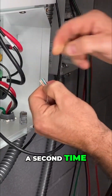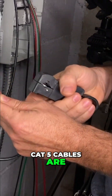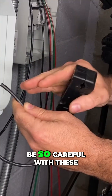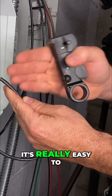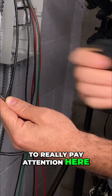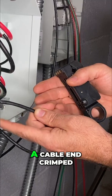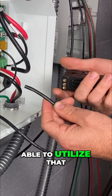Check your color code a second time. Crimping your own CAT5 cables is a really common source of human error. You just have to be so careful with these — the wires are so brittle. It's really easy to get wires crossed or get a bad crimp, so you just have to really pay attention. When you crimp both ends, you can use a CAT5 testing tool, but in this case we're not going to have a cable crimped on at the LG Chem side, so we won't be able to utilize that.